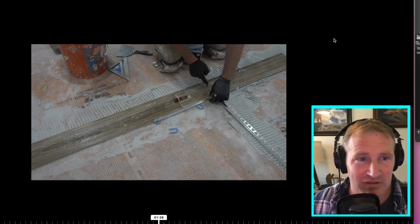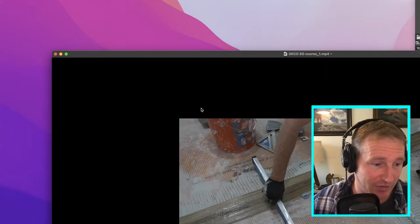If you're planning ahead for a curbless shower, it's really important to install that U-channel, because there's nothing worse than not being prepared when the glass guy comes out. There are unfortunately a lot of glass companies I've seen that put screws right into your waterproofing, which is a really bad idea — water will build up there and potentially penetrate your floor. You don't want to spend all that money on waterproofing and then have something like that happen.